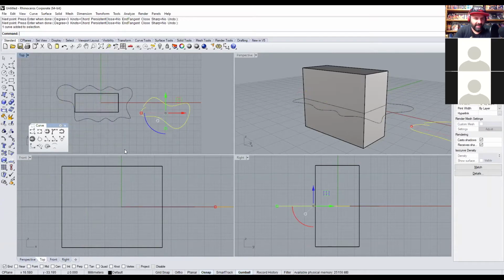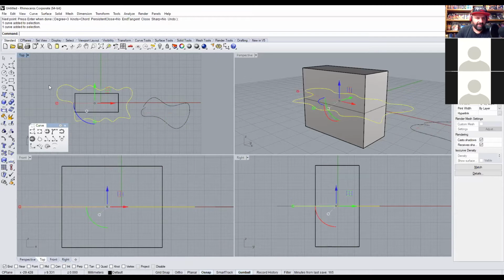All right. That might be okay if you're just doing a visual design, but when we're building things for engineering and manufacturing, we want to have things seamless and closed 99% of the time. So down here, let me use my magnifying lens. Here's my cursor. Down to the bottom, we have the place where you can enable and disable the way that Rhino snaps to an object. So End is basically you're snapping to the end of a point. You can also snap to a particular point. You can land anywhere near a curve. And we'll go over these as we go along. But just keep this in mind down here, that this is how you change the way Rhino snaps to an object. Okay? Keep that in mind.